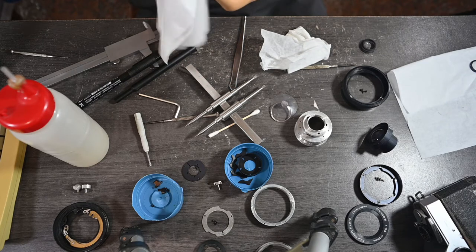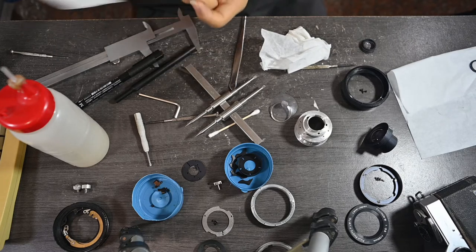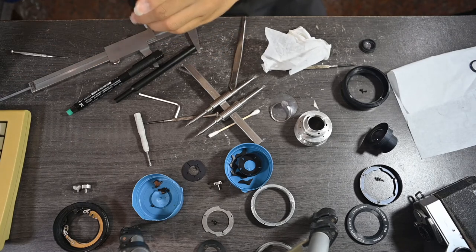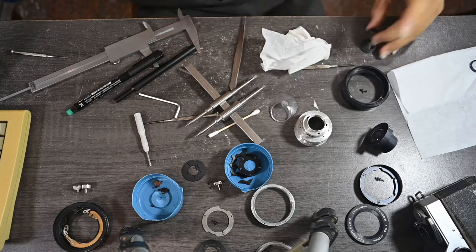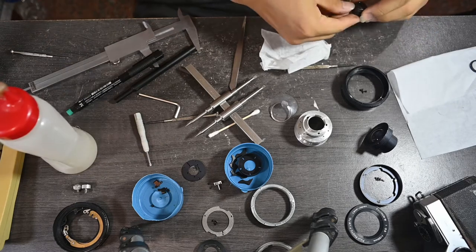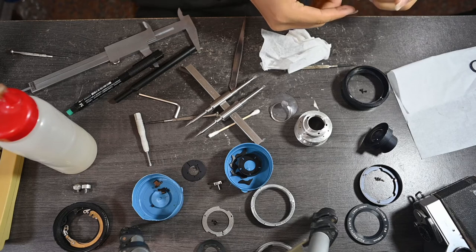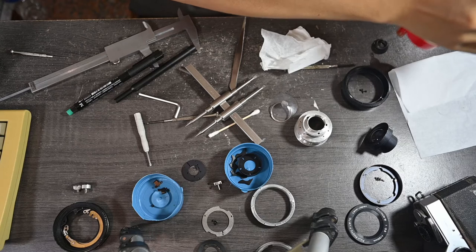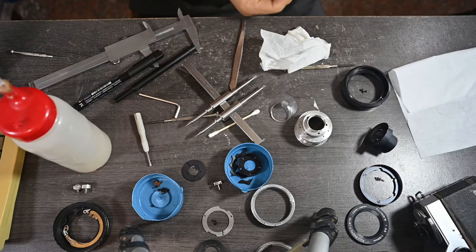The second one, both of the sides are concave, but the way you find which one is the inside one is the larger optic is gonna go inside the group and the smaller one's gonna be exposed. Just get this guy dropped down into the cell, or the optical block, and then you want to have this ring go into this guy. There you go. Then just screw this thing on, and you should be done.